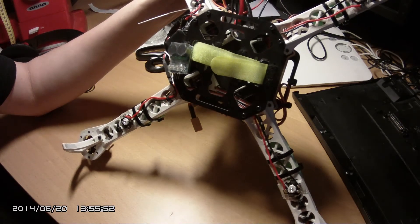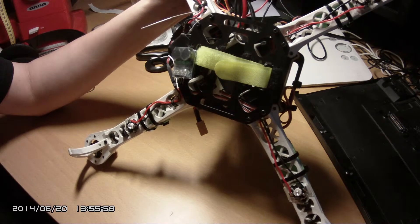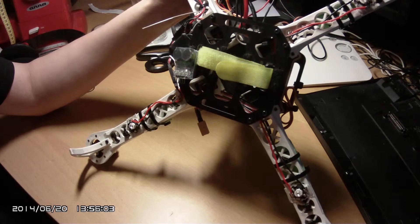The super bright LED option requires a bit more tinkering, soldering, and knowing what you are doing, but I would recommend them for anyone who has problems with grasping orientation with their quads. The color and placement of the LEDs, by the way, is totally up to your own preferences. I, however, prefer the international standard navigation lights style — green on right side, red on left side — even though the lights on your quad don't have anything to do with actual navigation lights on an aircraft. I found that more than anything else, I had problems with right and left while flying reversed, that is the front towards me, than with forwards and backwards, and I suggest you give that a thought, even though most people seem to prefer a car-style lighting.